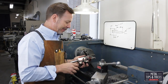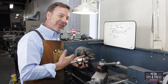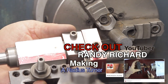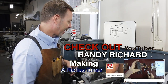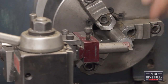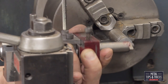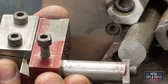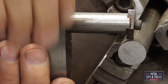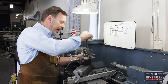I have not done a video on how to make this — this is actually my third prototype. They keep getting smaller and more condensed, and I don't have one that I really like enough to show yet. But I do want to show you that this design is available. They're very easy to use — just like any tool, you just set up to the center. I can adjust the radius by simply moving this dovetail, bring it in, rest it right on top, back it up and tighten it down. That should be a close enough radius.